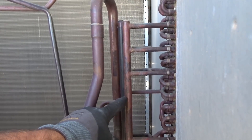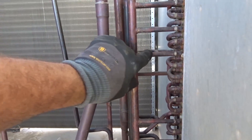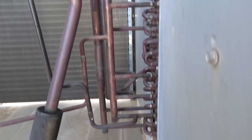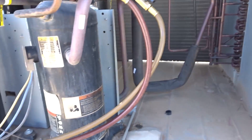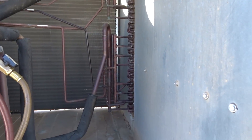This is something that plugs carriers. The liquid line comes in here to this common header, and right in the dimple of each one of these is a metering device — one per each circuit as it goes in. What they say is happening is basically the oil breaking down, turning into wax or something, and it starts plugging those up.